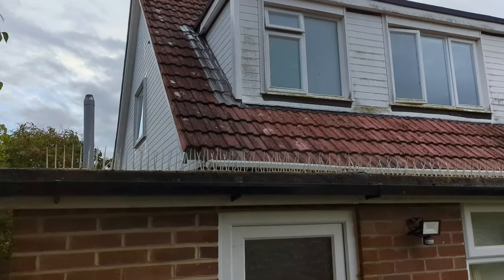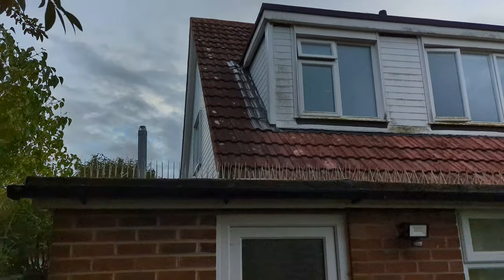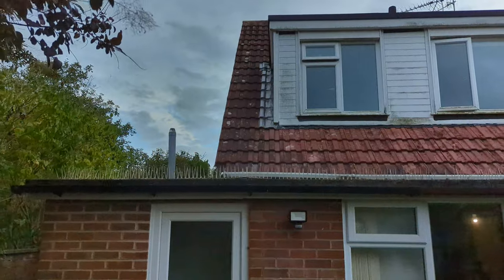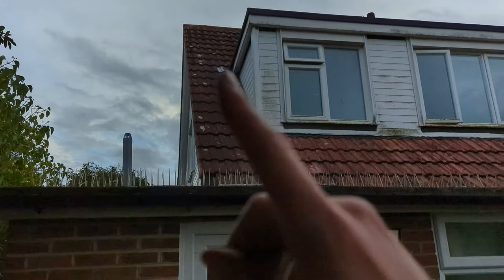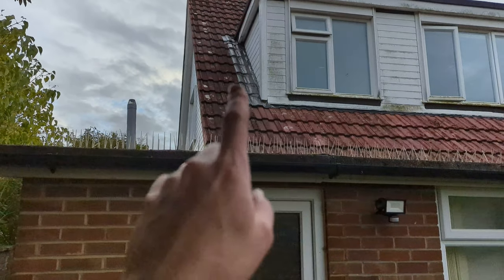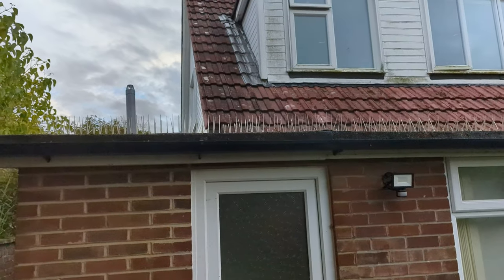Well, that was hard work. If you're a roofer then you are a hero because that is hard doing that. So from ground level you can see the flash banding — maybe in the future I'll put some lead up there, we'll see, see if it leaks first. I'm very confident that's not going to leak now with that membrane all the way across, lapped up the side, membrane over the top, and this flash banding. Let me know what you think in the comments down below — if you're a roofer feel free to tear me to shreds, if you're a DIYer feel free to do the same. Let me know if I've made any mistakes or anything I could improve, and subscribe as well please.